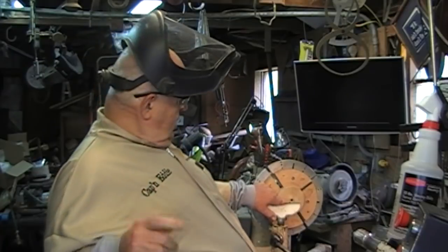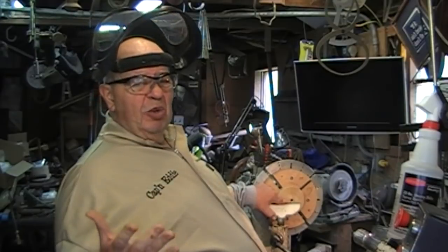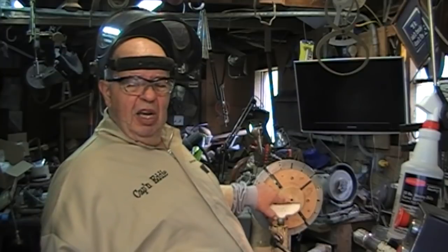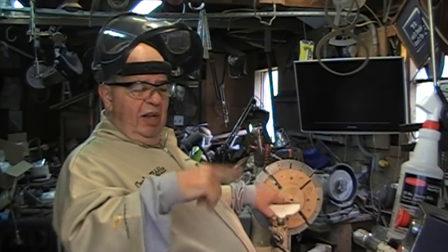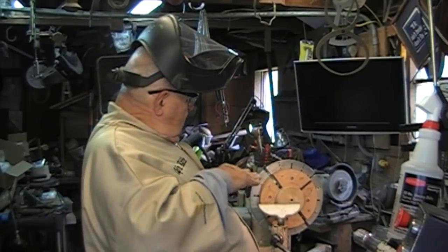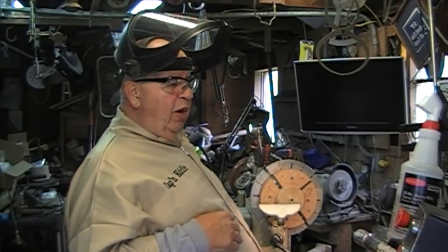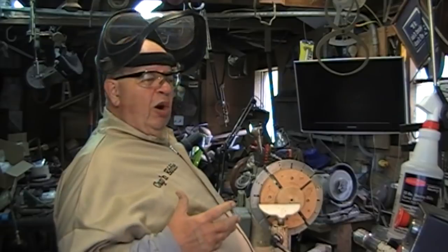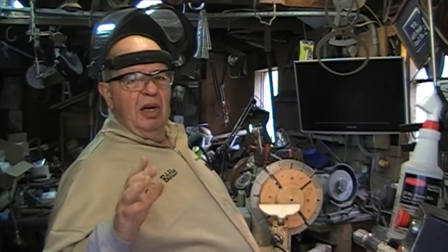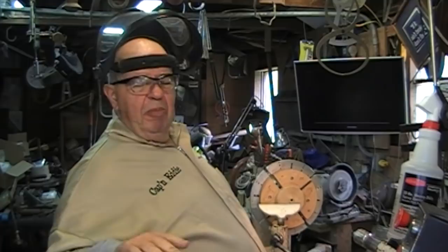All right, got it? Now, you can do this with carbide square edge tools. The only practical use for a square edge carbide there is, because it will make those cuts. And since you have a 3/8 inch opening, you can take a little shear every time, so the tool doesn't go dancing around on you when you try to go through. You can take some plain cuts in on the shape to reduce the bevel on it. Several things you can do, but if you're not comfortable, put the brakes on. I want you to be comfortable with the cuts you're making. Anything feels dangerous, stop. Think it through.